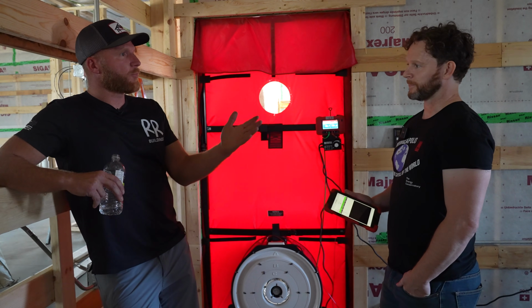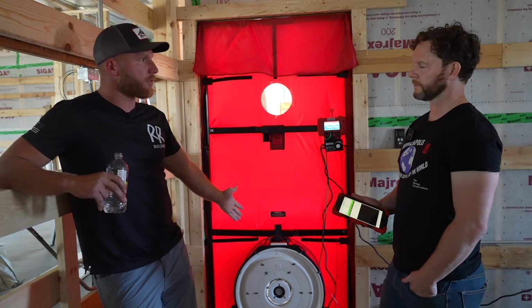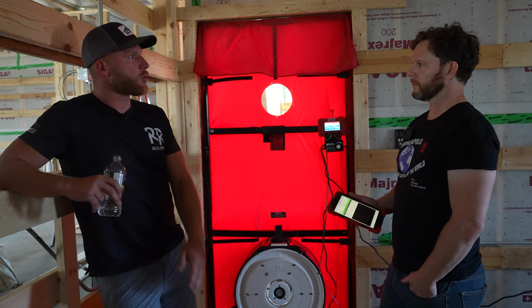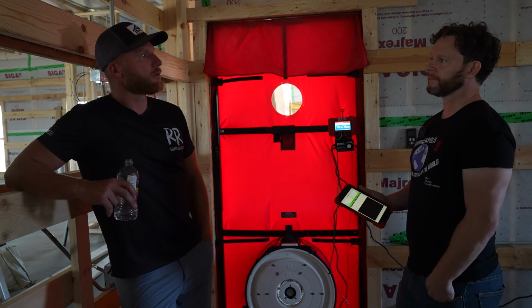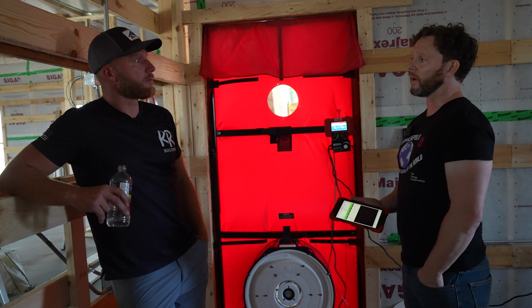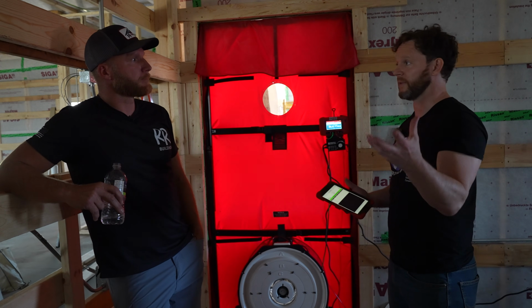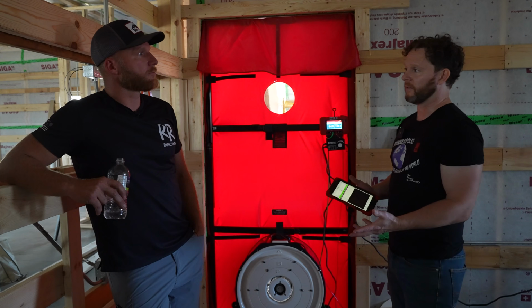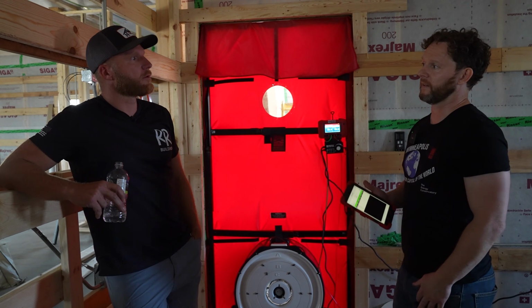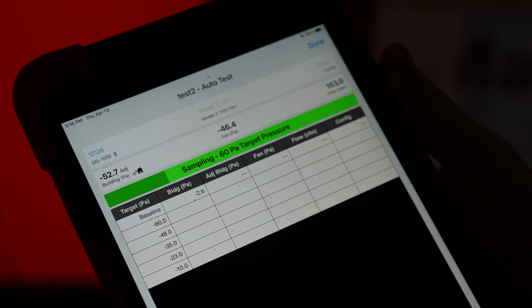But doesn't that also help with the HVAC systems? When you know that you're going to be at a 1 or lower or whatever, that's going to size the equipment totally different. You've lowered your load. Save money. Yeah, for sure. Homeowner's going to like it better. It's a little more work too, because you've got to work with your contractor who's putting in your HVAC system, and if they size it with a big system, it might short cycle. So you've got to do this and take the next step and work with your contractor to make sure they right size that system.